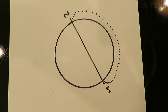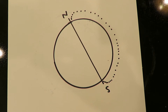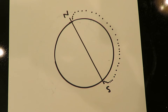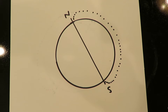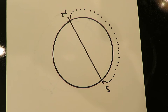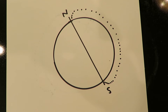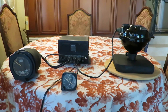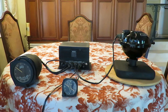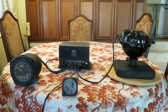For other reasons, when an airplane is turning to the west or east, away from a northerly or southerly heading, there is an error in the compass reading due to the compass being tilted and being affected by these vertical components of the line of flux. In addition to the vertical component of the lines of flux, there are several other sources of magnetic compass error.